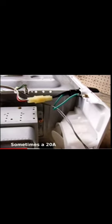If your microwave is not working at all and you have no power to the display or anything else, you may just want to swap that fuse out because it may have gotten worn out over time. If you change that fuse and notice there are no problems for a little while, then you're good to go. But generally when that fuse blows, there's a problem. You would just pop the fuse holder open and check the fuse right there.